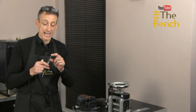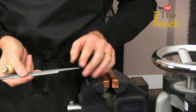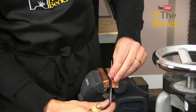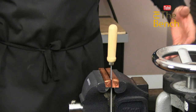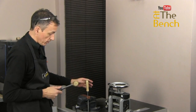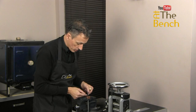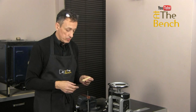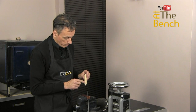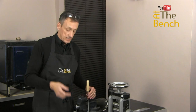What we're going to do is heat up that tang. The steel is hardened, but only the lower area is hardened. The tang is normally left soft because we need to heat this area until it is nice, bright red. Then we're going to put it into our vise. The handle will go on top and you'll start to see smoke come billowing up — that is great, that's what you want. Then with a nice heavy brass hammer, we hold it central on the tang and start to tap. Every time we tap, the metal is burning the wood and burning the shape of the tang into the wood. The wood will not split; the ferrule on the end will stop that. The handle will come down to roughly the end of the tang, and it will be nicely, securely fastened.